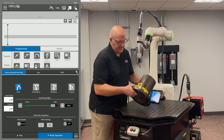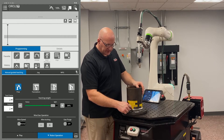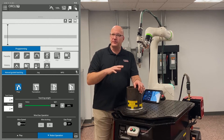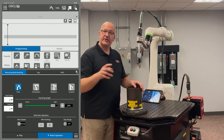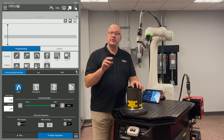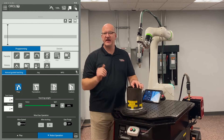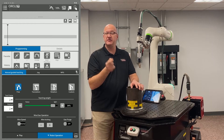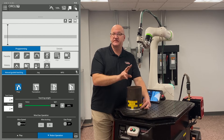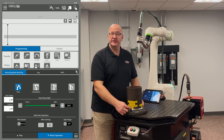When doing a circle, we start with a weld start — approach the part just before the weld start point, come down, and do a weld start. With newer software that's a 'weld start with motion'; with older software it's 'basic arc.' Then go 90 degrees and put in a weld point C. With newer software, place it after the weld start with motion. With older basic arc, drag the weld point C inside the U-shaped icon — you'll see two points, but it only recorded the first one.